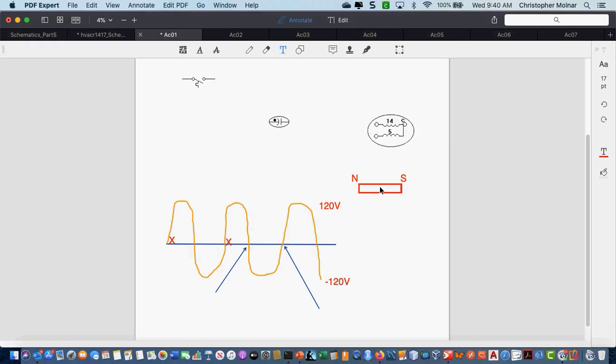If my motor is caught between two positions, if my motor has a heavy load on it, it becomes very inefficient because the entire magnetic field collapses where this goes through zero, where I suddenly have zero potential, zero voltage to the coil, and zero magnetic field. Now again, it's just a split second in time. Think about it, 60 times a second. That's not that great of a time period, but it's enough to affect the efficiency of a motor.